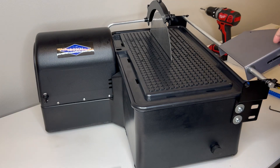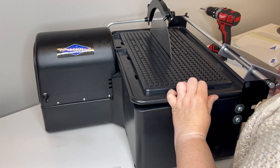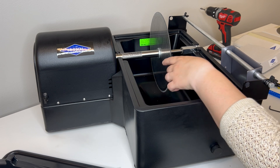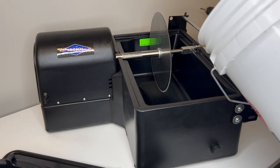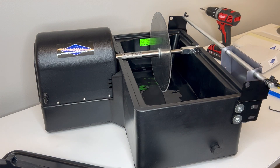I'm going to lift that off so we can add our water. When adding water, you only want to cover the bottom of the blade by approximately a quarter of an inch. What I typically like to do is cover just the area of the diamond, which is about a quarter of an inch — a little bit extra is fine, but not too much.